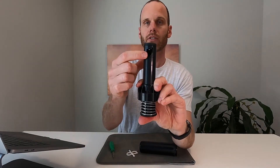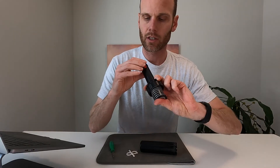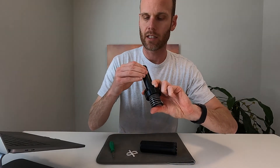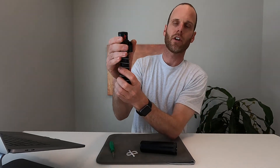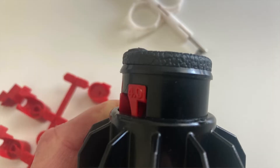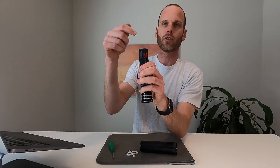This is what the head looks like without any nozzle in it. We're going to insert the 4.0 right-side up so you can read the number, and it will slide in at an angle. Press it down until it's flush — if it's not pushed in far enough it won't be able to retract all the way when the head goes back down, so make sure it's fully seated.